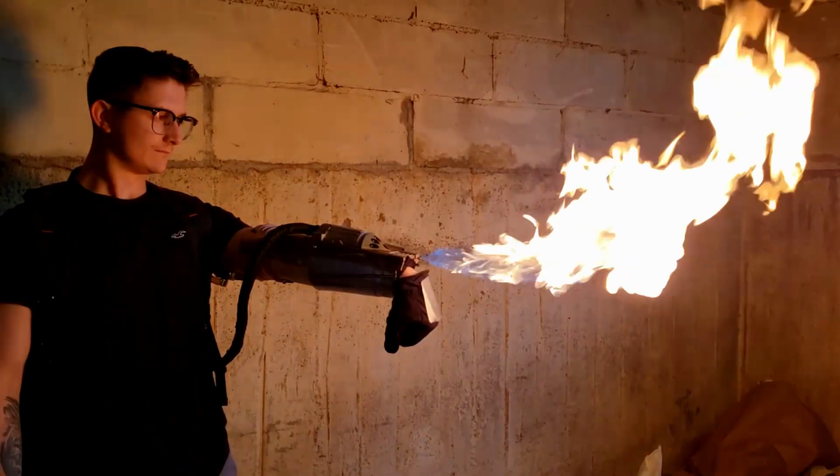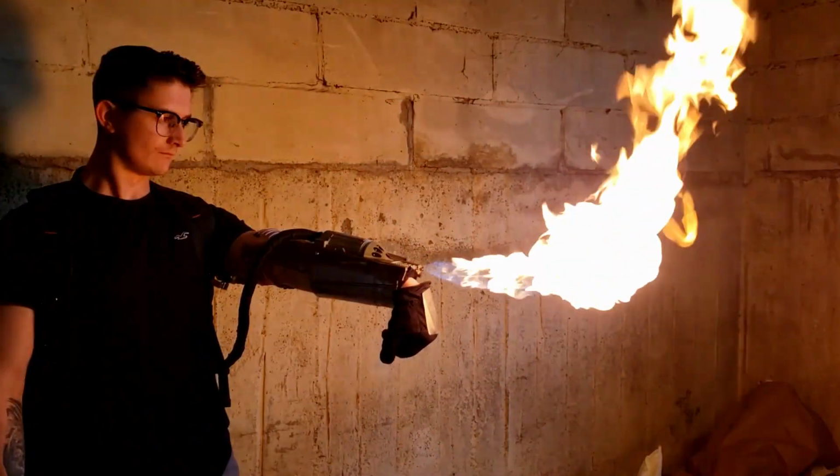We have the switch at the wrist location, just like we used in the Whistling Rockets thing. I decided to use that again because in the clip it doesn't ever really show what he does to trigger his flamethrower, and I wanted my hand to be out of the way anyway. So by pressing my arm down and away from the flame, it activates these inputs. Those inputs on the Arduino are basically glorified timers and relays that will turn on when they're supposed to.